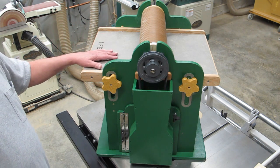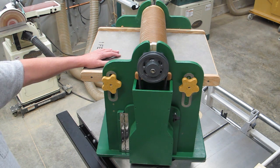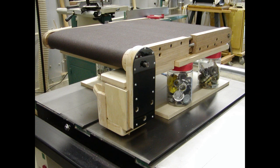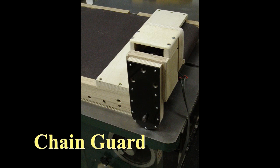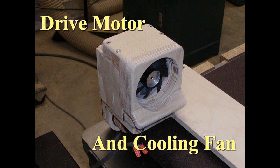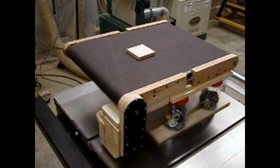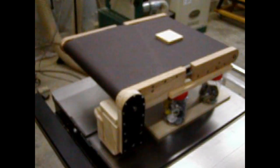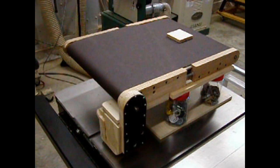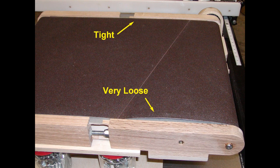So I made a motor drive unit for this. In fact, I was so convinced the motor drive was the right approach that I built the whole thing before I even tested it. This is a picture of the power feed that I built. While the conveyor appears to be running quite well, I never could get the belt to track straight. I exchanged rollers, swapped rollers end for end, turned the belt over, flipped the belt around — I tried every possible combination and never could get it to track straight.